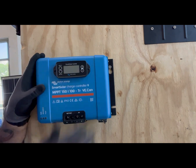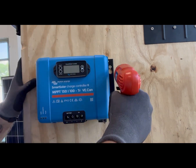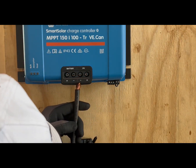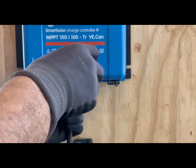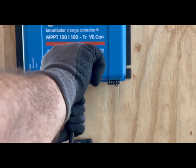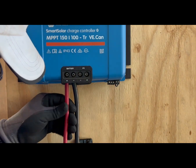It's very easy to mount and easy to secure. Installing a large gauge wire is very typical for these charge controllers — this is like a 2 gauge wire, and it's probably the maximum size wire this will fit. Always do a little tug test along your wiring.